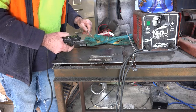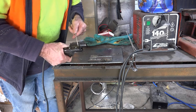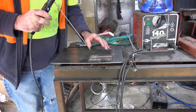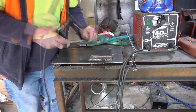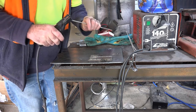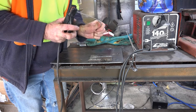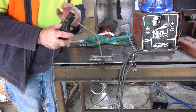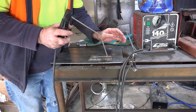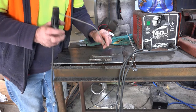Another thing when you're first learning — if you have a look inside your electrode holder, you can see there are lines in there, and the lines correspond with your welding rod at different angles. You need to find the right angle you're comfortable with when you first start to strike your arc. There's not much point having it too far away. What I do is put it back towards me, and sometimes I'll put a bend in it like that — it gives me a little more control. The further you are from your electrode holder, the more the end is going to wobble, and you just can't really strike an arc. Mind you, my hands shake at the best of times.